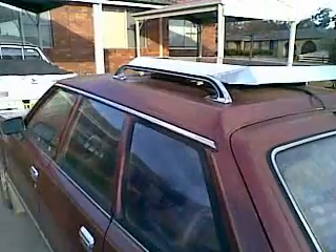And don't call us Aero Hillbilly Enterprises for nothing. The Brumby's burning 4.2 litres of fuel less per week regardless of how often it's driven, and the 1800 Touring Wagon is burning 5.33 litres per week less regardless of how often I drive it. I'm saving 760 mils per day because the solar panel makes it up to the battery for sulfation, and the dashboard clock and stereo memory chip sucking away at the battery all the time.